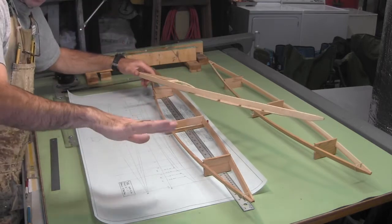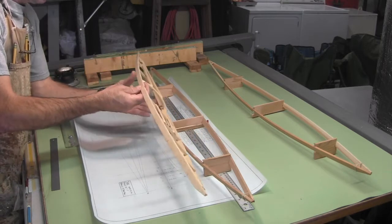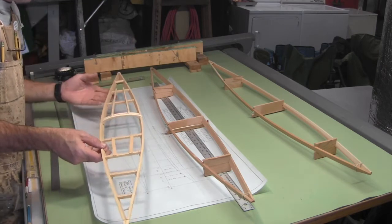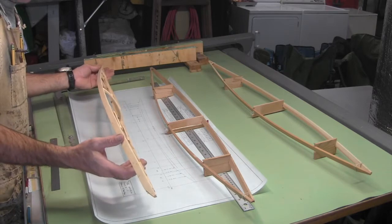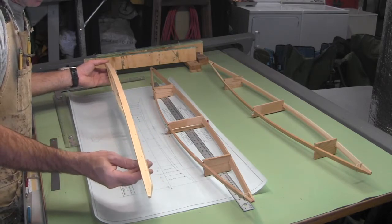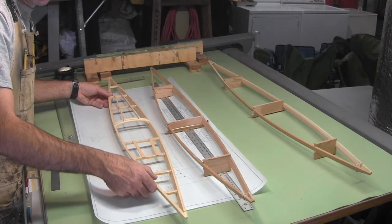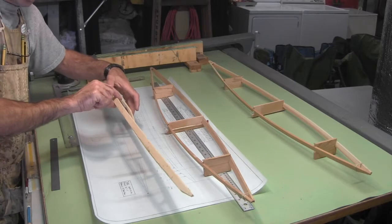Using an 8-inch wide plank to cut this gunwale stock seems a bit wasteful. I could probably make use of about 60% of the waste material elsewhere in the boat. But I'm still not loving the idea, and finding stock that wide and clear is getting more and more difficult and certainly more expensive. So I think the best solution is to steam bend the amount of shape into it — though it's a bit of a guessing game as to how much you can steam bend in and how much will spring back out.